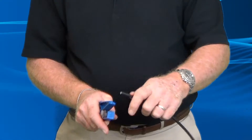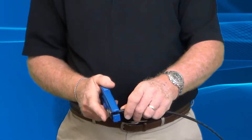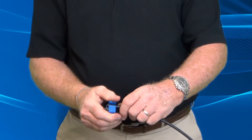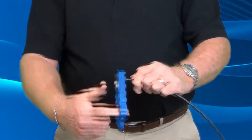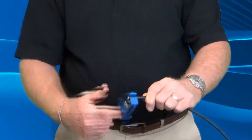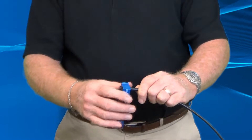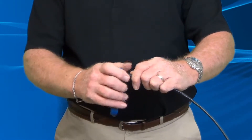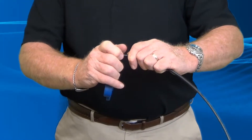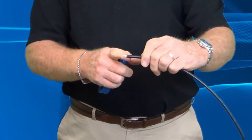On this tool there is a positive stop. You open it up and put the edge of the cable right against the stop. I always give a slight pinch to set the blades, and then you start the turns. Listen for it and feel for it. Five turns is the maximum — all you need. At that point, just slightly grip the tool without pinching it and pull it straight off. That makes the proper preparation.